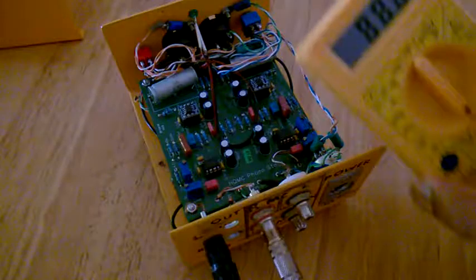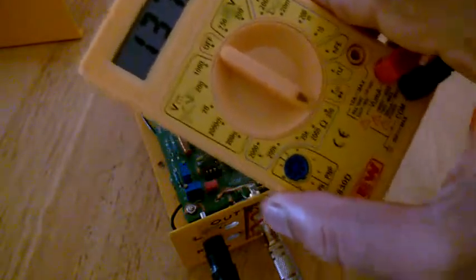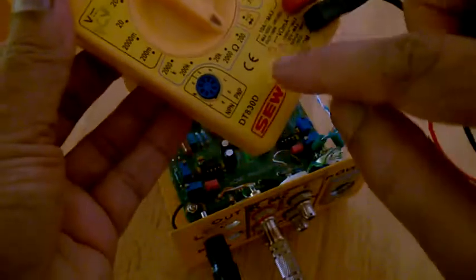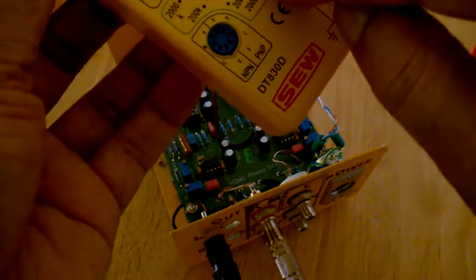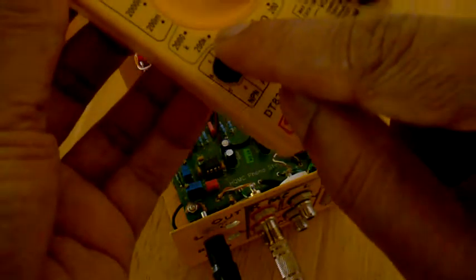So here you could have a digital multimeter. I have the digital multimeter here — it has already started reading and I selected 200 ohms. Start from 200 because we need less than 1000 ohms. You have 200 or 200,000 ohms available, but start with the lower number.